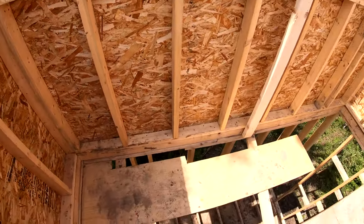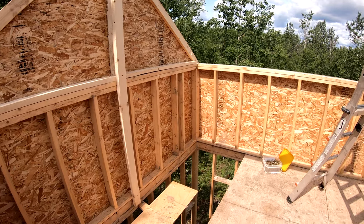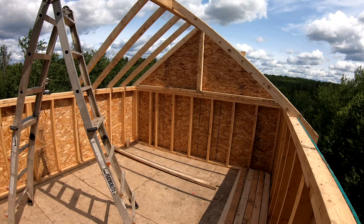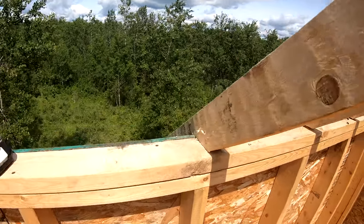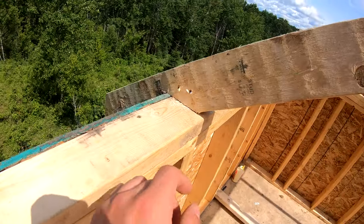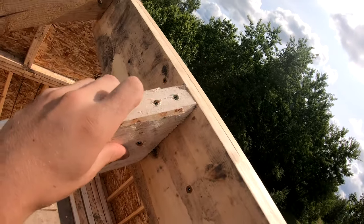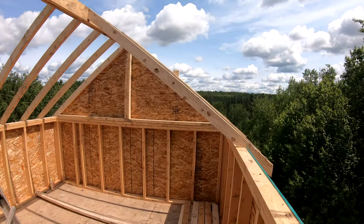The layout is going to be: everything downstairs will be for cooking and all the essentials — the wood stove and all that. Then all my everyday stuff will go up here in the loft, and my bed's going to go right there with the windows there. Not all these rafters are perfect — you see this one's a little bit off on the outside, but pretty good. On the bottom I put two screws on each side, and up top I go one on either side then two up the top there. Just keep giving her slow and steady — she wins the race. It's really starting to look like a house.